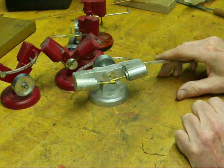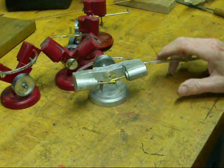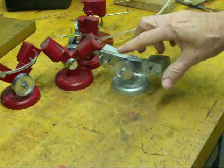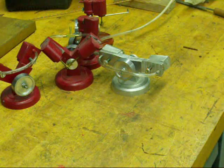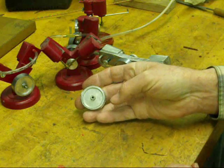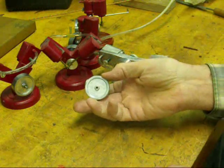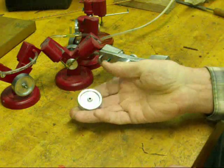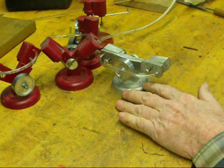They also all use the same flywheel, which is made of lead. I have a little permanent mold in which I have poured these little flywheels, the same as you might pour lead sinkers. They weigh a couple ounces each and they always work real well.